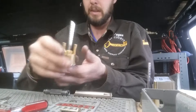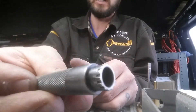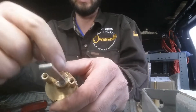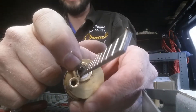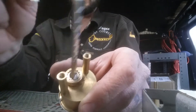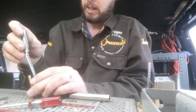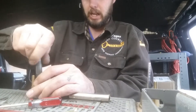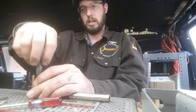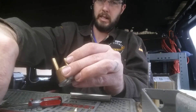It's got a factory key. Basically it's just going to come apart like your average lock. I got the tool here — this slides over and depresses the detent right in here that you can see. You can also do this with a screwdriver, just push that down and twist this cap off, but this is much faster. So we're going to go ahead and put that on there, go over the tailpiece just like so, spin the cap off, and set it all down right here.